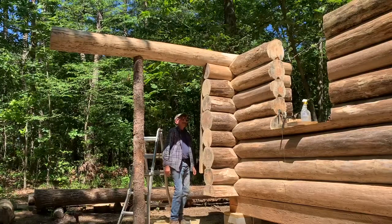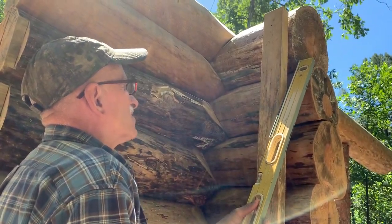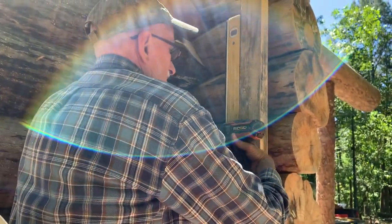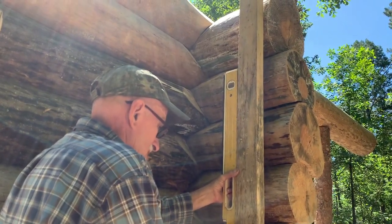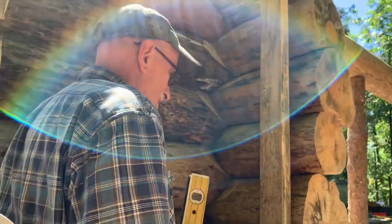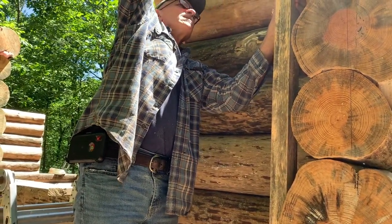From your tools. Yep. This is my shortest log up here. It's about 15 and a half. So I set that back a half off there and my saw come real close to hitting here. So I've just got it swinging with one screw. But you want to keep this level. Some of the logs are setting like this, curved. So just try to put your screws in lightly. So the end will be square? Yeah. If you suck these down hard, they won't stay square. Because you don't need much to guide. I can do it with my eyeball, but not this good. It's loose, but it's less stressful that way too. All you gotta do is the guide just gotta follow that, even though that's moving a little. Don't matter, as long as you keep your sight straight.